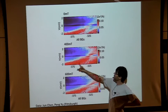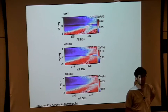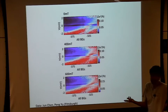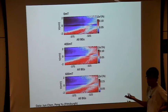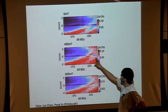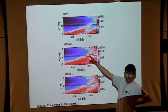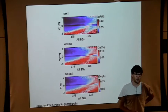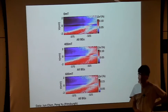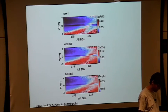And there is some kind of a large conductance feature going through. So that could be the Van Hove singularity of a subband. So that would be fantastic, because that is now a telltale sign. We see something like this and they say, ah, Majorana is supposed to appear here. Not here, not here. Here. This would be the subband edge, and that's where the gap is closing. And let's play with this idea, and let's kind of run with it.